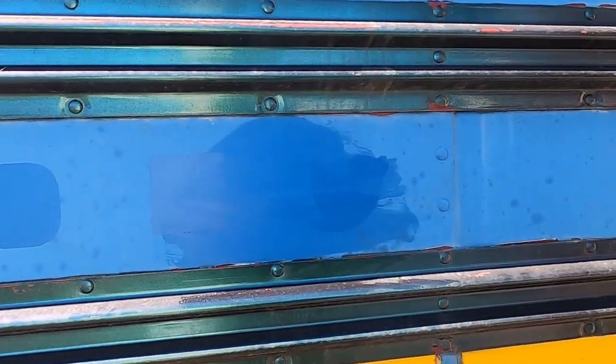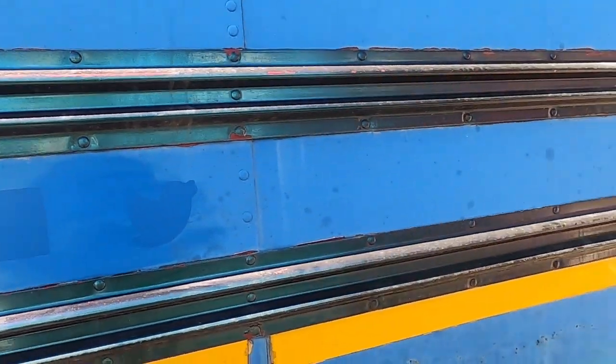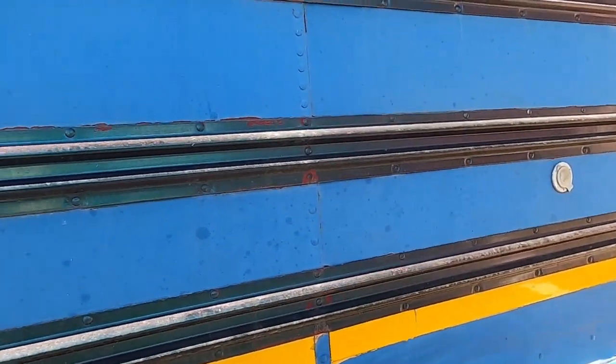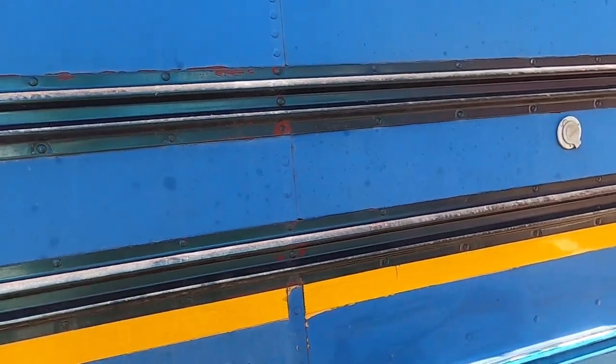Once it flashes off, this is the moldy oil and this is where it's cleaned off. I pretty much have to wipe down this whole side — it's worse from this rub rail down, but there are still spots up here too. You can't paint over oil or it'll just fish-eye on you, so the first step is doing that, and then I'll address the rust that's starting to pop through.